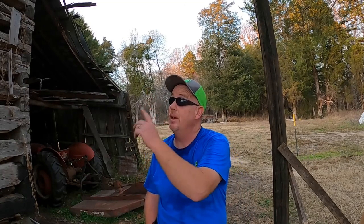I guess, like I said, going straight up there and toe screwing those rafters in, coming right back down wasn't that bad, but no, I do not like this at all. The barn's got the lean to it, so it's kind of thrown everything off. I can't measure off the end rafter like you normally would to put purlins up. I'm having to come back over here and double check where they're joining, and then get back over there, and then the slope of the roof, everything's slick, is sliding. I about got that last one too short on the joining up here.